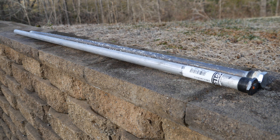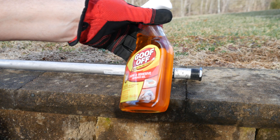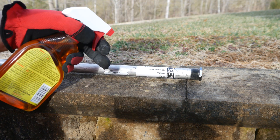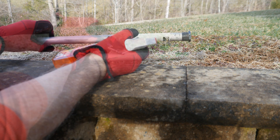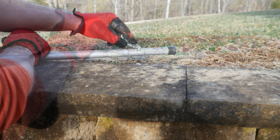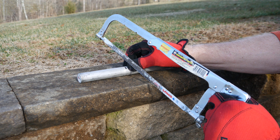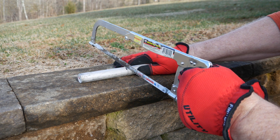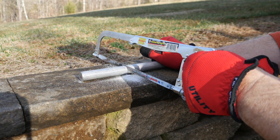The standard length is 48 inches, but the last rod I installed had to be cut to 44 inches because it would not seat properly, most likely due to all the sediment in the tank bottom. The labels on the new rod need to be removed — I soak them in an orange-based adhesive remover and scratch them off with a razor blade scraper. Four inches was measured and cut off the end using a hacksaw; the magnesium was actually tougher to cut than the galvanized pipe. I recommend using an electric Sawzall for this if you have one.